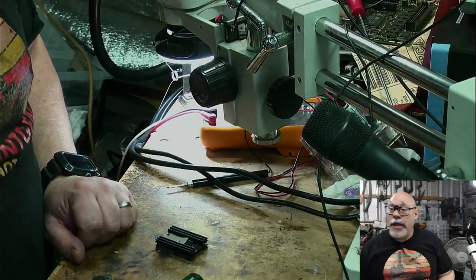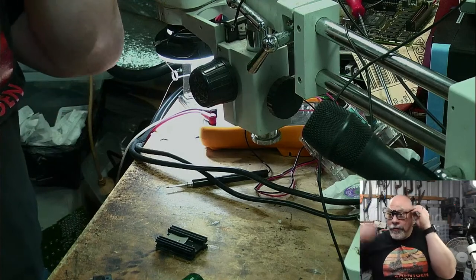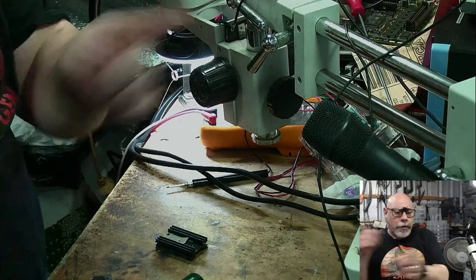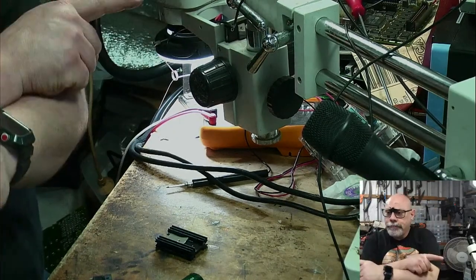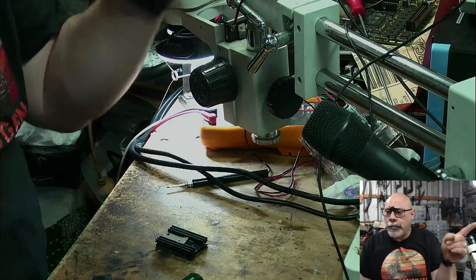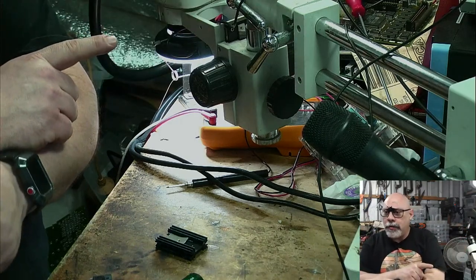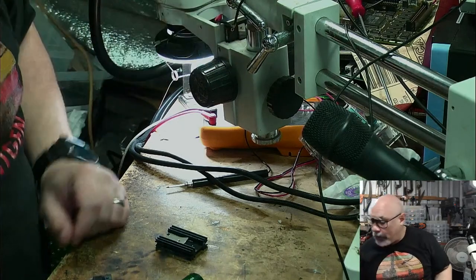How do I know it's caused by that part failing? I know because I put a good one in from another Color Classic and it worked perfectly afterwards. I had two Color Classics, and I swapped the component over. But that is not a long-term solution for a repair because either way, I'm going to end up with one that doesn't work. So that's how I know.